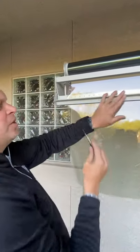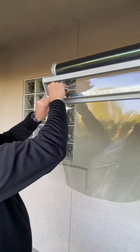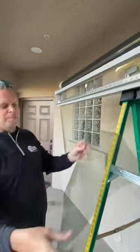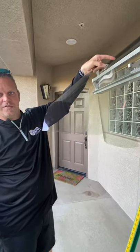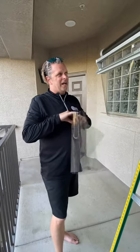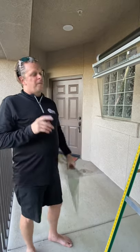Take our knife — I always like to hold the clamp just so it stays precise and stays square. Boom! Perfect 18 by 20 inch piece. If you're doing French panes, this is a must. If you're doing security film, anything higher than 4 mil, it's the best investment you could ever possibly do. I'll put a link in the description for the film handler — a link for the 72-inch one. Best money you could spend. Flat glass guys, go buy one.